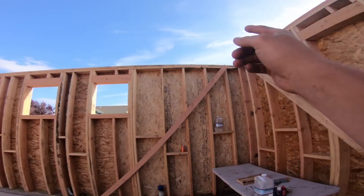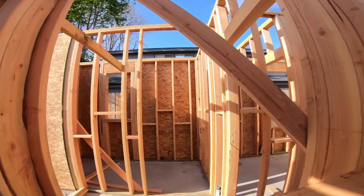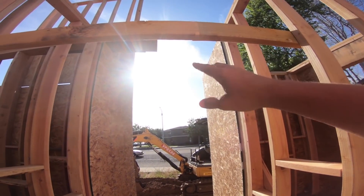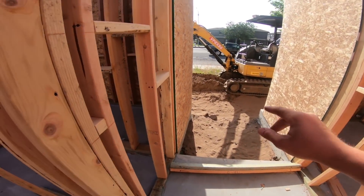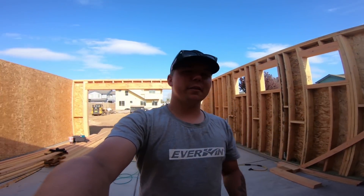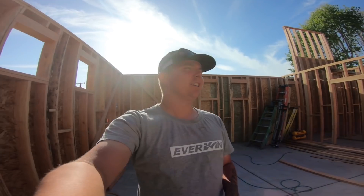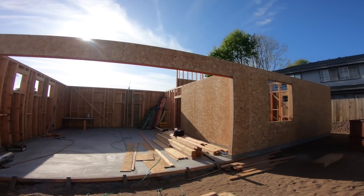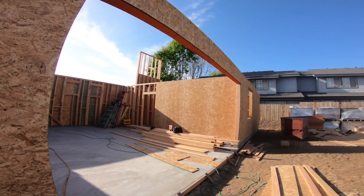We need to router out these windows. We are completely sheared out. We have this entryway door to frame and that is the last of our framing. The stair stringer runs into the entryway, so we're not sure what's going to happen there yet. This place was really simple and straightforward - some places call for 8d and then 10d nails, three-eighths and then half-inch sheets, 2-and-12 and 6-and-12 patterns. This place is all 10d's, 6-and-12 - can't get much better than that. We are completely wrapped up and ready for our floor system. Day four, not looking bad for two guys. Tomorrow we have a couple of helping hands come out because we need to get those PSLs in and there's no way we're getting them in with just two people - they are longer and bigger than that.